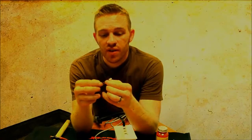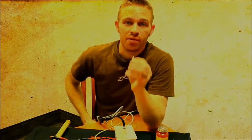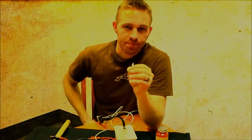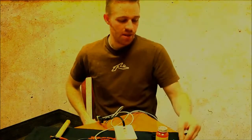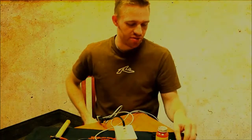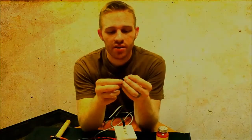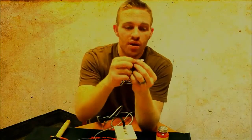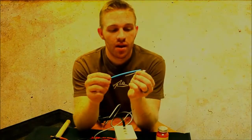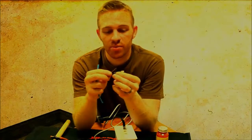The reason I chose this resistance value is it makes the LED light up plenty bright, and it turns out that serial ports have a very low amperage threshold that they can transmit. Because this varies between manufacturers, I chose 1.5 kiloohm in order to be safe. You're going to want to solder this resistor — it can be on either side of the LED — and once you have it soldered, you're going to want to heat shrink it. Make sure you heat shrink the entire length of the resistor. You can clip the ends off, which will make it a little easier.